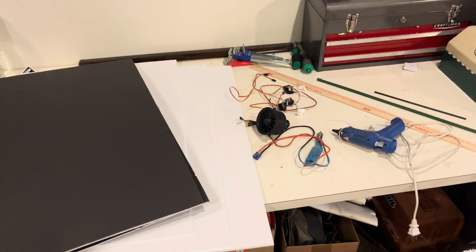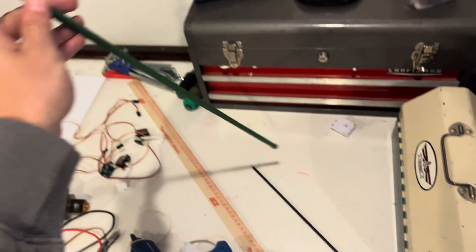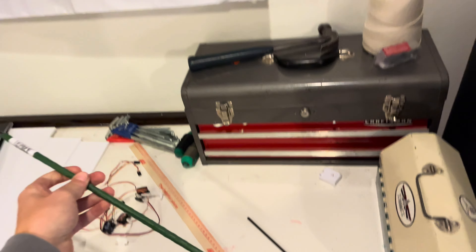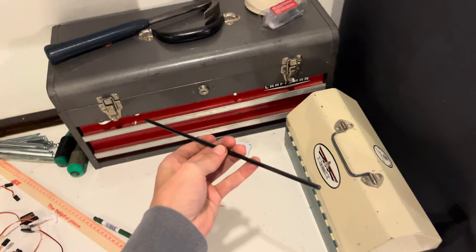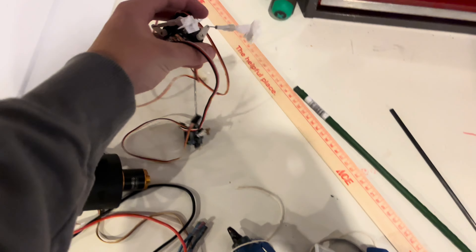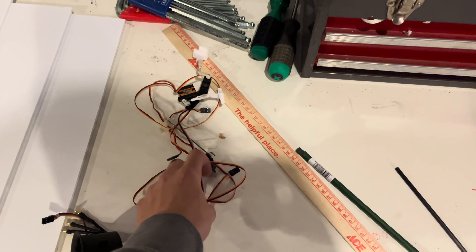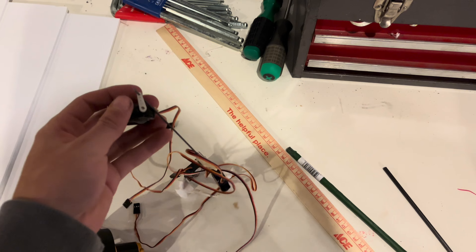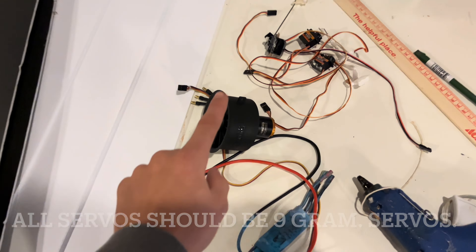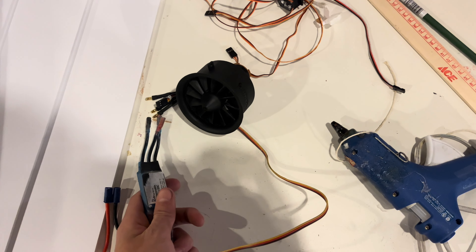Here are all the materials you will need to build this airplane. You're going to need a hot glue gun, a yardstick, one spar — you can usually get these from Home Depot or Ace Hardware. Another spar, which you can find elsewhere. You'll need three servos: two for ailerons, which should be identical with the same length on the control rods and control arm. Then the rudder servo, which doesn't really matter — just a cheaper older one. You'll also need a 64mm EDF and a 4S ESC that will plug in.